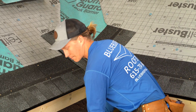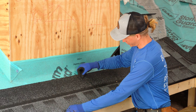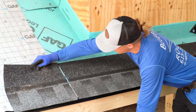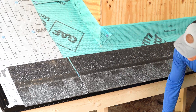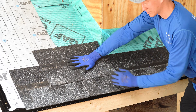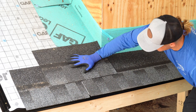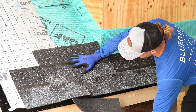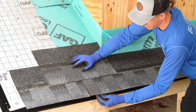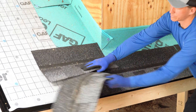I'm going to quickly give you a practical walkthrough of what the starter strip is and why it's important. If we put the shingles on without any starter strip, this is what it's going to look like — I'll leave that gap right there just for visual purposes. Water is going to get into that gap, and the starter strip goes underneath to protect that area from getting any water. So we need to make sure that our starter strip is always covering these laps properly.